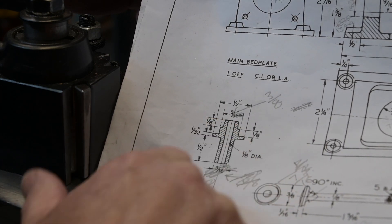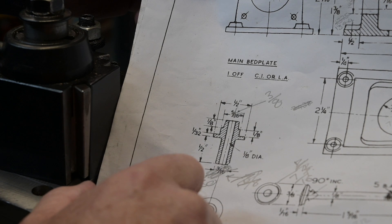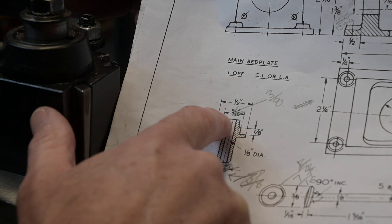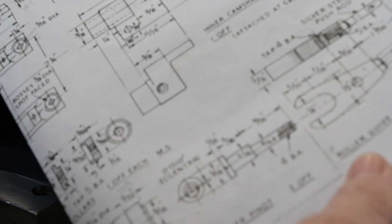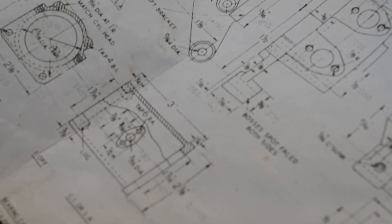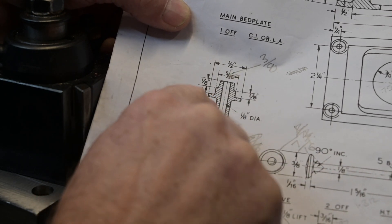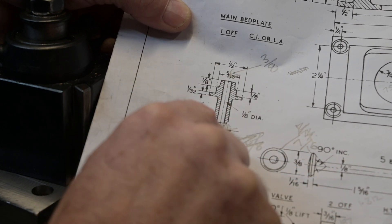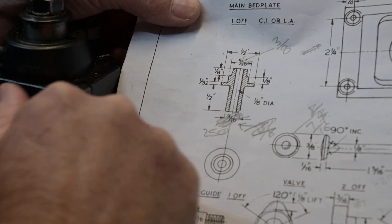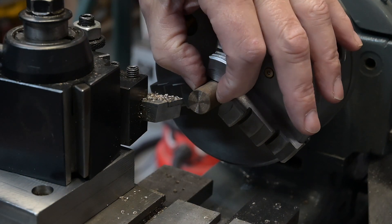Right, this is what I'm doing now - this is the exhaust valve guide. This piece here is 500 by 250. Ignore these measurements, they're not correct, so it's a 250 by half inch. I've measured the spring. Also on this side the measurements have changed because when I drilled the holes I sort of cocked up a little bit on the measurements. So that's what we've got in the jaws at the moment. This piece here is half an inch plus 1/32nd, so that's 0.531. That also needs to be 500 across here at the extremity of the 0.031 measurement.